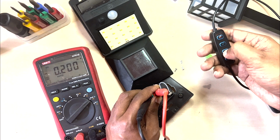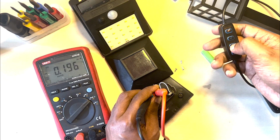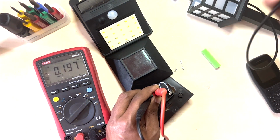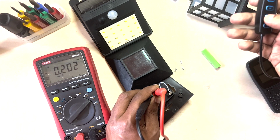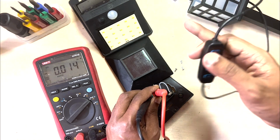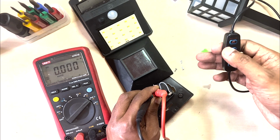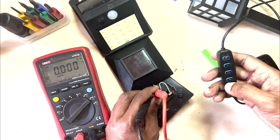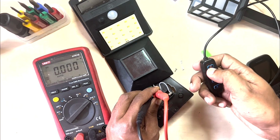Yeah, we can see different current generation at different color temperatures as well. That's because the visible light spectrum coming from these different lamps is somewhat different, and solar panels generate electricity, or electrons, depending on the energy of photons coming from different spectrums. If we are going to discuss the mechanism, it mainly depends on the materials used to fabricate this solar panel. Unfortunately, we don't know which type of material is used for this solar panel. Commonly it's silicon.